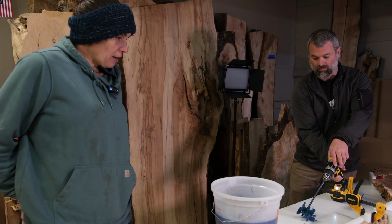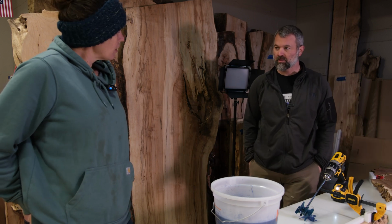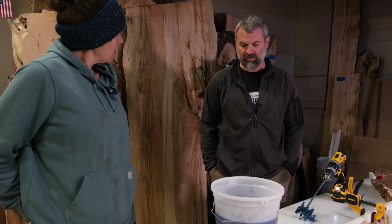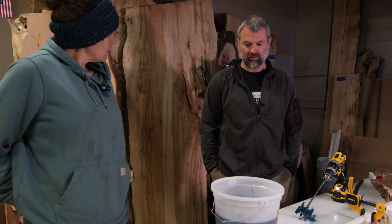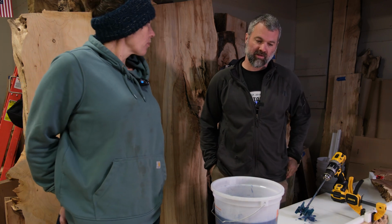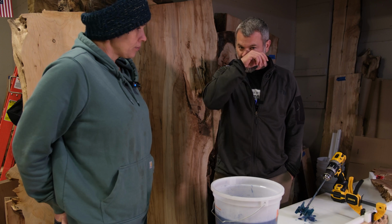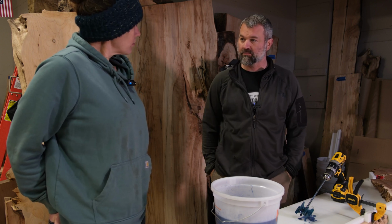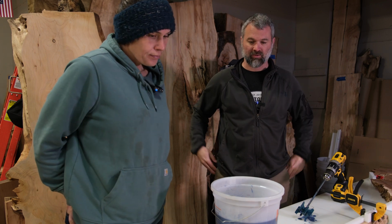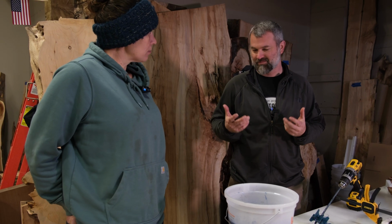So at what point do you have to worry about everything catching on fire? For the epoxy, you mean? Yeah, like the heating cycle. If it was 80 degrees in here, then maybe you'd look at it overheating that much. But if we poured a 1-to-1 2 inches thick, then you would have smoke. I don't know if I've ever heard of actual flames occurring. Just the smoldery effect, and then it cracks and fizzles. So think chemical fire.